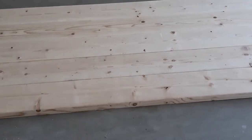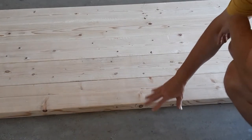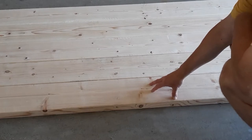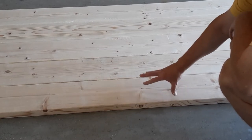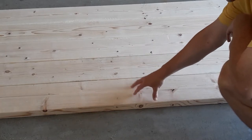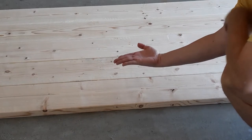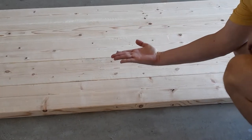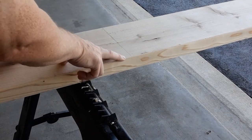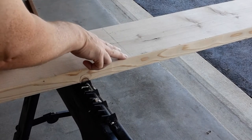If you didn't understand what I meant by leaving them face down — the good sides of your boards — you may have a lot of knots and some nicks and dents, maybe even little cut marks from the factory. Instead of having to sand them all out, put your good side down. Then when you put your stringers on and flip it over, that's now going to be your top surface. Here are our cut lines. We're going to go ahead and cut this with a sawzall, jigsaw, circular saw, or just the hand saw.